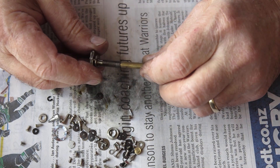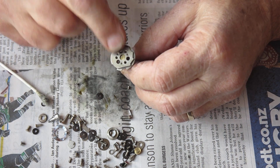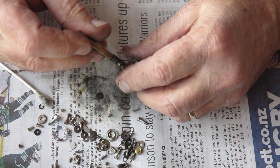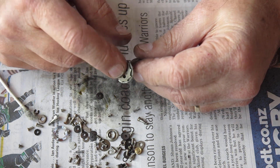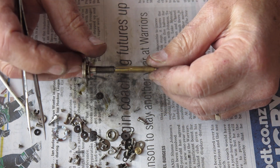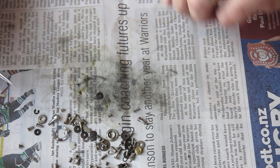With the film advance shaft, one of the problems you sometimes get is that the little cam on the base is loose on the shaft — it's only riveted on, with the shaft squared off where it runs through and then riveted over. If the camera's been dropped with the film advance lever sticking out at an angle mid-stroke, it'll loosen up where it's riveted, and then you end up with that plate wobbling. If that plate wobbles, you have a problem with setting the point at which the film advance is released to allow winding to the next shot — which should happen at exactly the same instant the shutter fires when things are good.